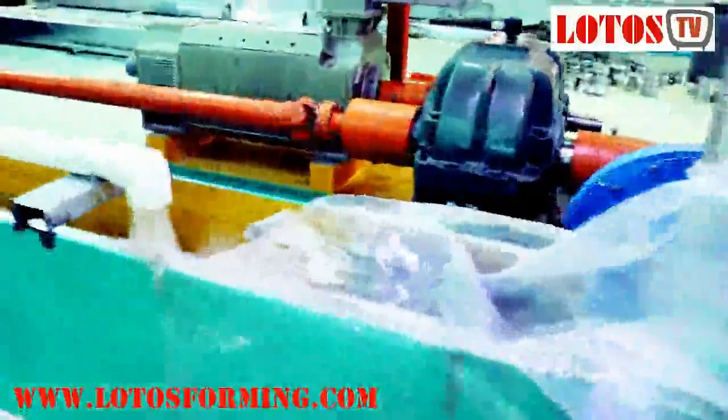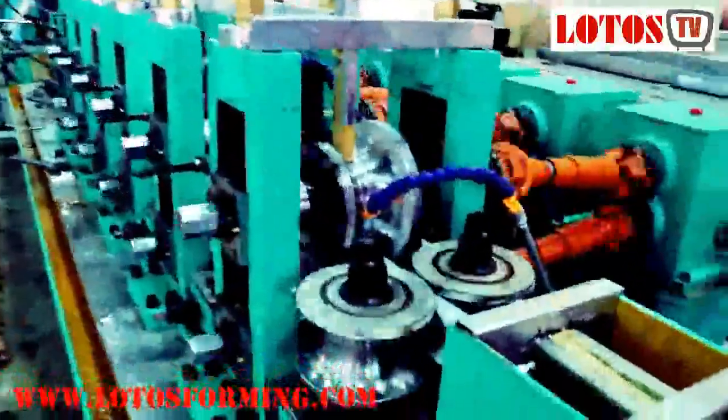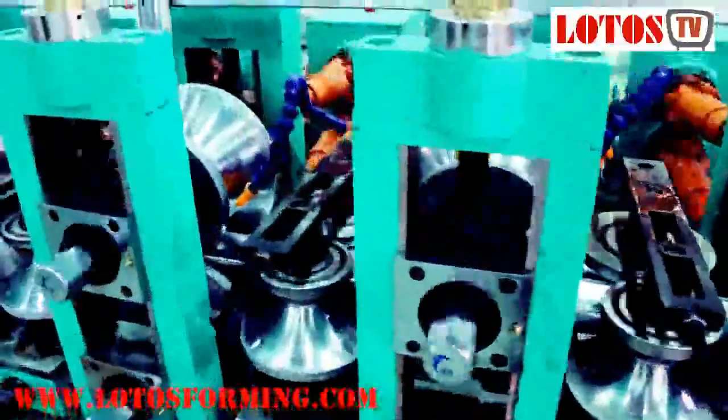The tube mill production line is a series of machines that build pipe with steel strips of a certain width. It starts by decoiler. The flattened steel strips will be sent into the forming machine and the rollers of the machine will bend the strip to a round pipe shape. The round pipe will then be sent into the weld box where the tube is welded by a high frequency solid state welder. The welded pipe will be formed to expected shape in a sizing machine after that.